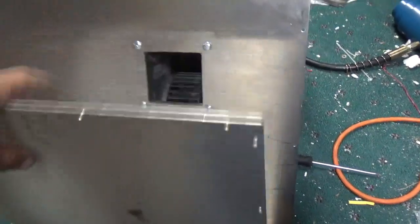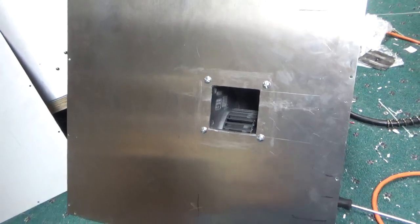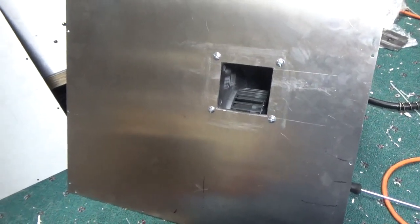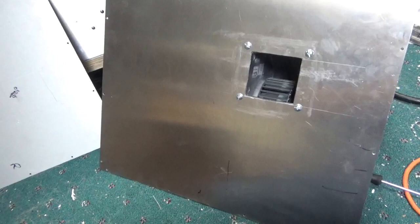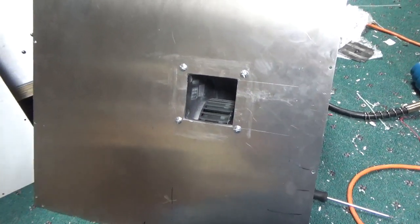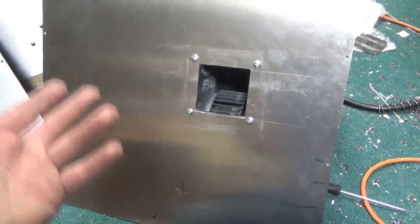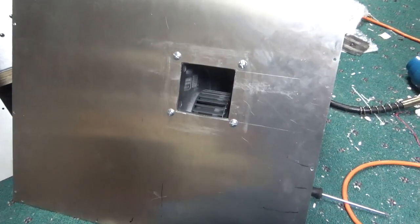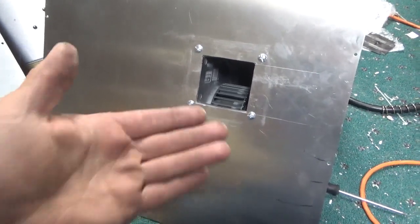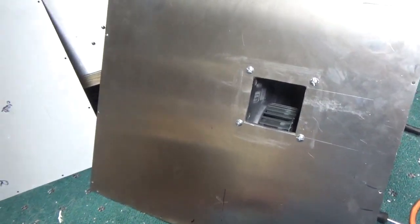This blower, like I said in the previous video, has a higher CFM and pressure rating than what is called for by the 3CX 6000A7 tube for its maximum dissipation at the intake temperature listed in the specification — around 120 degrees Fahrenheit. It would never actually be that hot. But it doesn't hurt to have more blower than you need. With a cooler ambient temperature, he wouldn't need the specs they list, but having more blower than necessary is always fine.